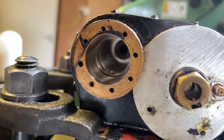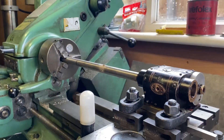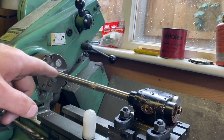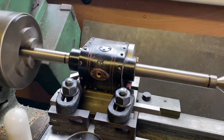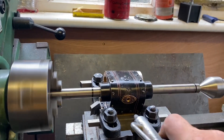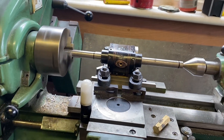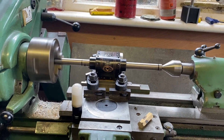I've now taken a cut which has cut all the way around - that was the second cut. I'm going to leave it in the machine and take another couple of passes at the same setting just to make sure it's cut nice and evenly. We're still taking a tiny cut - and just to prove that, if I put an airline in the port, you can see the swarf comes out the end. On closer inspection I wasn't happy with the bore - it still looked like there was a little bit that hadn't quite machined - so I've added another tiny cut of three or four thou and we're going again.